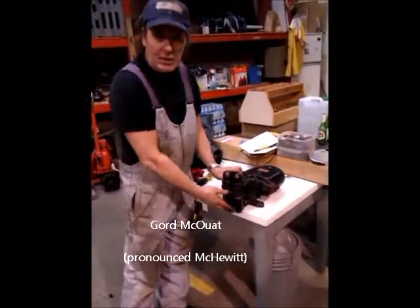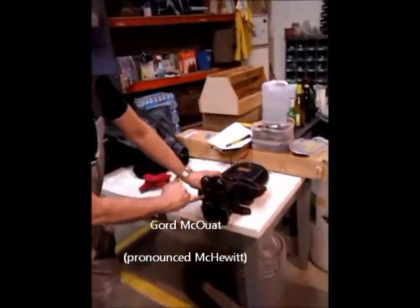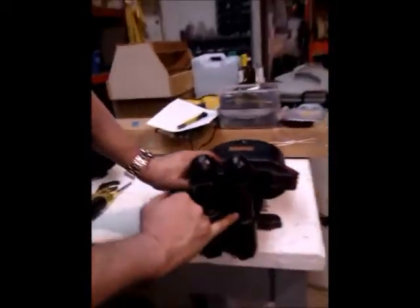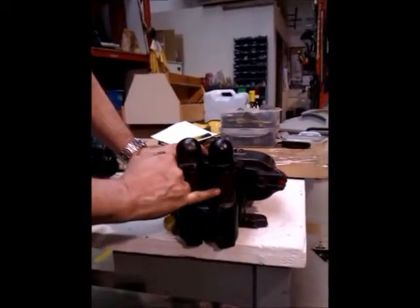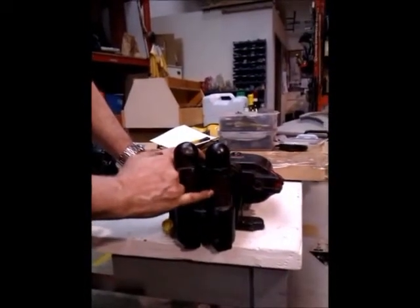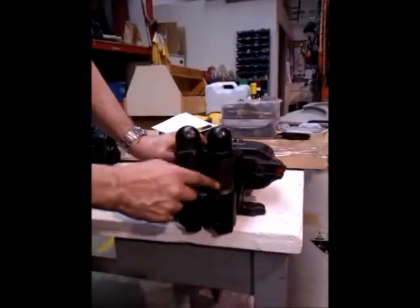This is the valve portion of the S6A Governor. This is the cut-out valve on the left, and the cut-in valve to the right. It has a vent hole. There should be no leakage through that hole if the valves are seated correctly, except when it's cutting in and cutting out for a matter of a couple of seconds.